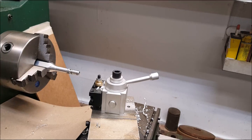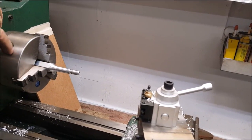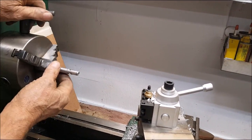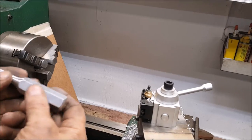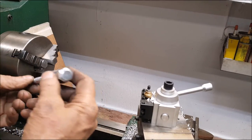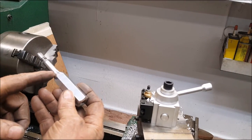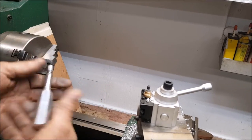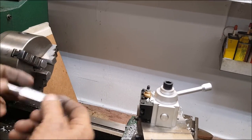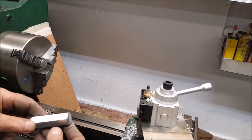Small piece of emery to give it that brushed aluminum look. And the way these are built, it's two pieces. There's a handle and then a part pressed in there, and you can see the serrations where they pressed them together. But it changes the whole appearance to rechuck this, and then we'll turn a ball or a long place or something on here.